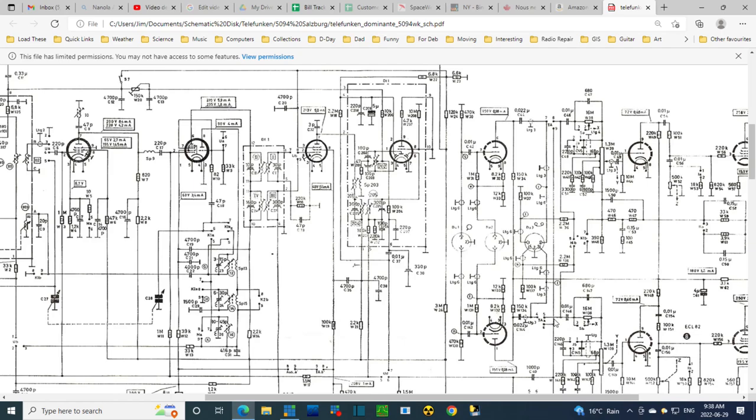Now we push the button to enable tape or phono and we start experiencing trouble. We have reconnected from 8-9 to 8-7. And the problem begins to appear. We've released from 9, so there's no longer a short between 9 and 6 here, ultimately supplying exactly the same signal to the two output tubes. So that's out of the picture. So we now have two separate channels as soon as we flip this switch.